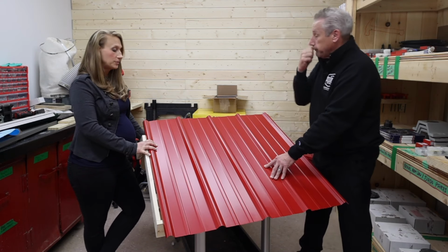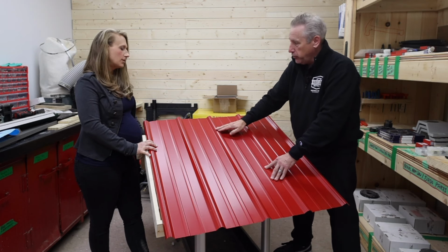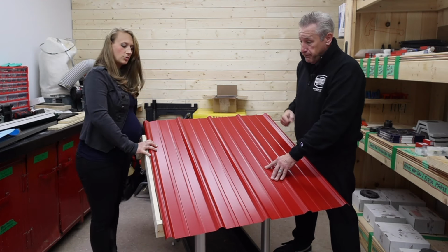That's a really good tip. You don't leave the very top screw. Don't drill it, just because there's no point putting a hole there. Even though the hole will be covered by the cap, don't put it in there. You want to basically leave the very top piece not drilled and not put in before the cap goes on. Yep. So you get it on.